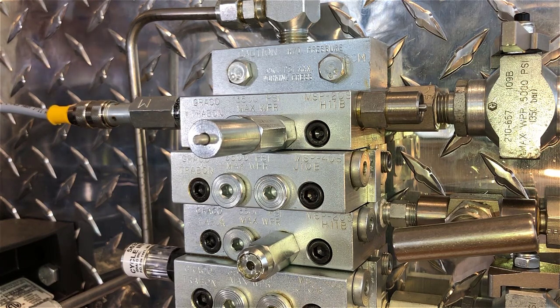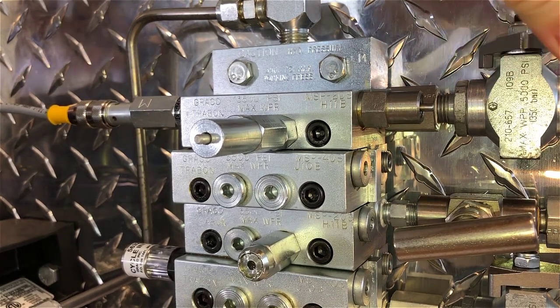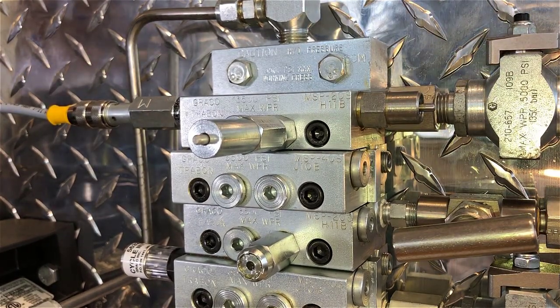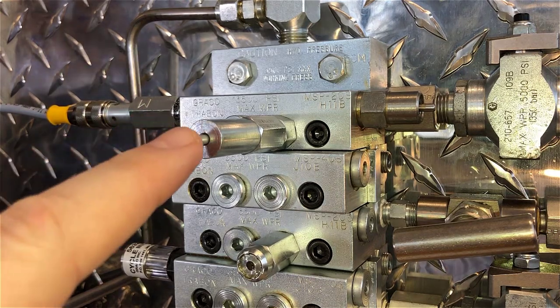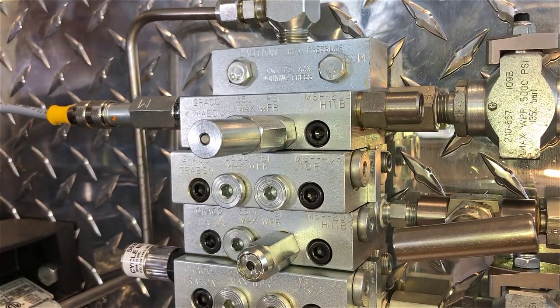There's the pin popping out, and even when we open the valve to clear the blockage, the pin stays extended. So now if you need to come troubleshoot this later and it's only a partial blockage that relieves the pressure itself, the pin is still sticking out. But once the pressure has been vented, you can press that back in to reset it — thus the name manual reset indicator.